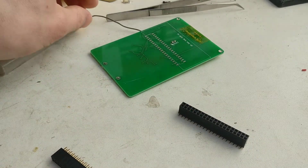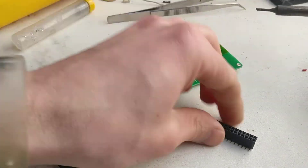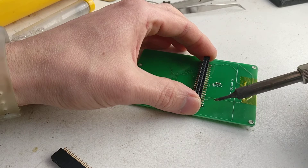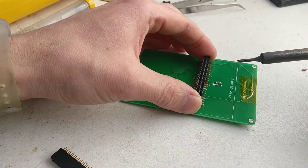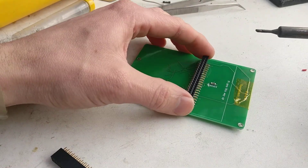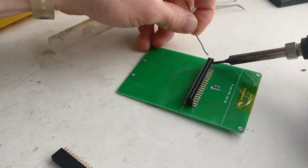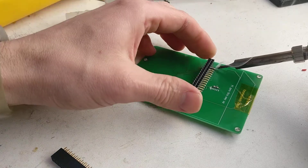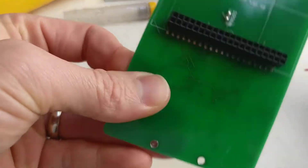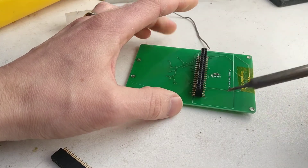With these, a similar thing — you just add one bit of solder to one pad. Get your part down. Make sure they're all lined up right. Because you're just putting one pad down, you can have a look — is it lined up? It looks pretty good. Is it quite straight? And if it is straight, just tack down the other side, another pad. Once you're completely happy with that and it's pretty straight, what I do is put a bit of flux down and then solder every single one of them.